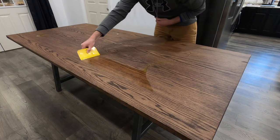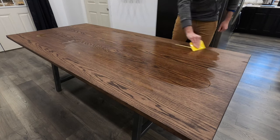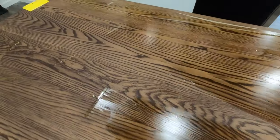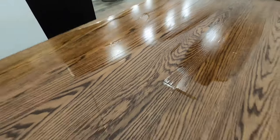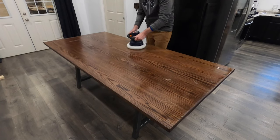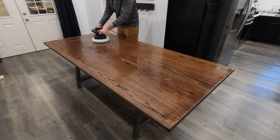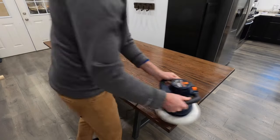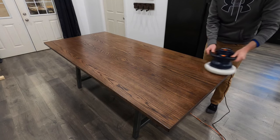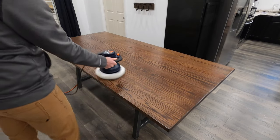This is two days later and at this point I went back and added Rubio's maintenance oil. This is another really expensive product but just a small amount will go a long way, so a large bottle of this maintenance oil will last a very long time. This gives the table a little extra bit of sheen — I did like the finish before this but it was a little too flat and the maintenance oil took care of that and made this look that much better. Rather than wipe this off with a rag you want to buff it into the tabletop. I'm using a cheap car buffer that I picked up off Amazon for about 20 bucks — probably should be using a better quality buffer with the right type of pad, but this actually worked out okay. I buffed that first coat in, let it set for maybe 10 or 15 minutes, and then with a new pad on the buffer I went back and buffed that off to where there weren't any waxy spots left on the top.